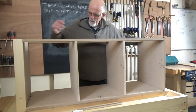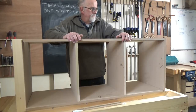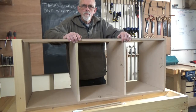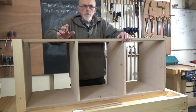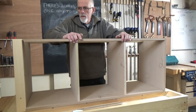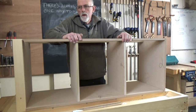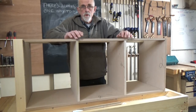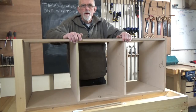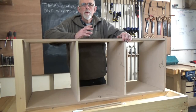So that's more or less it on the face side, face edge, just a fairly brief explanation. It is an important concept within the craft. One, for accuracy's sake, making sure you've got square, straight datum, and if your parts are square, the whole furniture should come out square eventually. And the other beauty of it is in aiding you with orientation and notation of the parts as you're working. If you're not using this concept at the moment, then I'd urge you to have a go and see if it helps you with your woodwork, because certainly in my woodworking career, it's become an absolutely essential part of what I do.